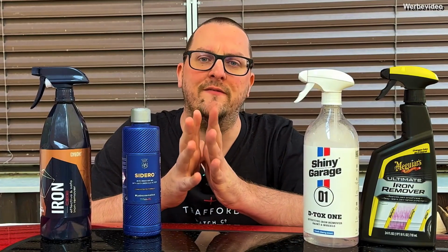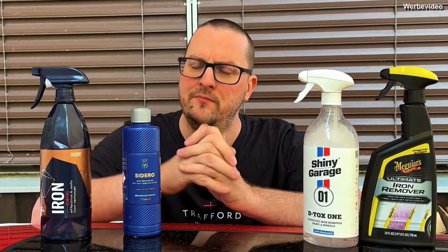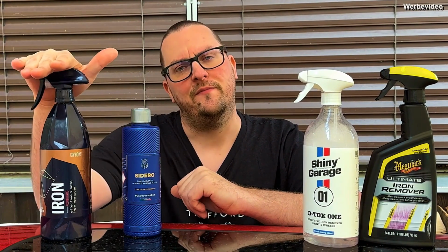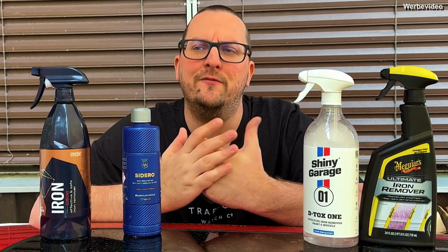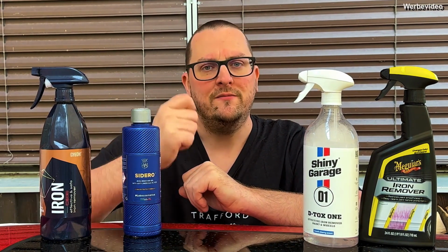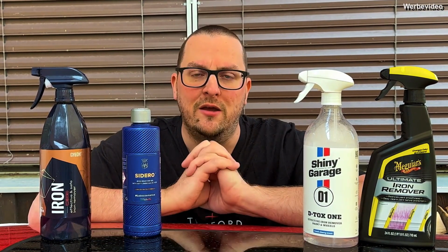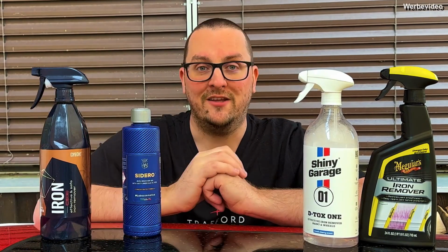And that's quite interesting. I don't think what I'm about to say applies to all products in this category, but we seem to see a connection between the performance of rust removers and their price. That means those that tend to be very expensive also clean relatively well. And I personally believe that this has a lot to do with the concentration of the active ingredient that is responsible for the color change, the reaction, and also for the cleaning performance. So to put it simply, the more of that stuff is in there, the better it cleans, but the more it stinks and the more expensive it gets in the end.